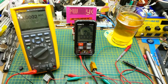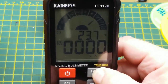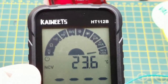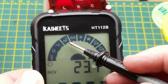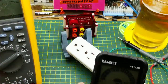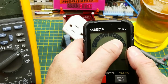With the lead still in current mode, tapping the function button only cycles through current measuring modes — it won't let you exit those modes with the leads in the wrong spot. That's a good protective feature. The meter has quite a few modes: volts, ohms, and continuity in auto mode; then millivolts AC and DC; frequency and duty cycle; capacitance; diode; microamps AC and DC; milliamps AC and DC; and non-contact voltage in both NCV and live variants.